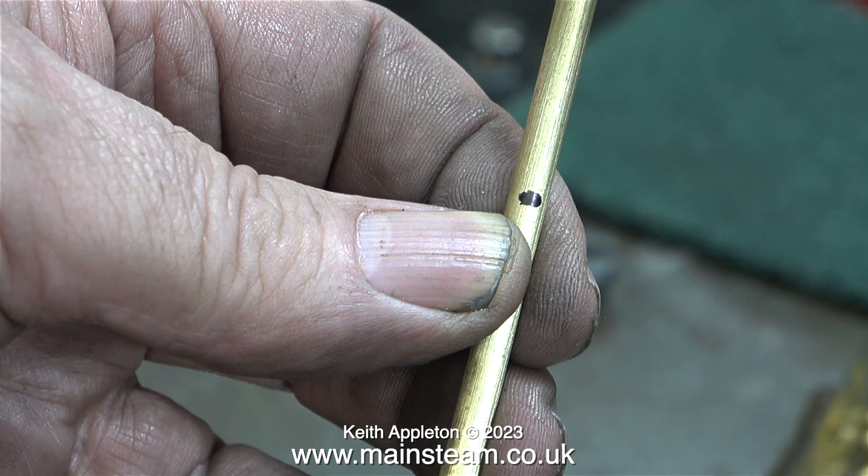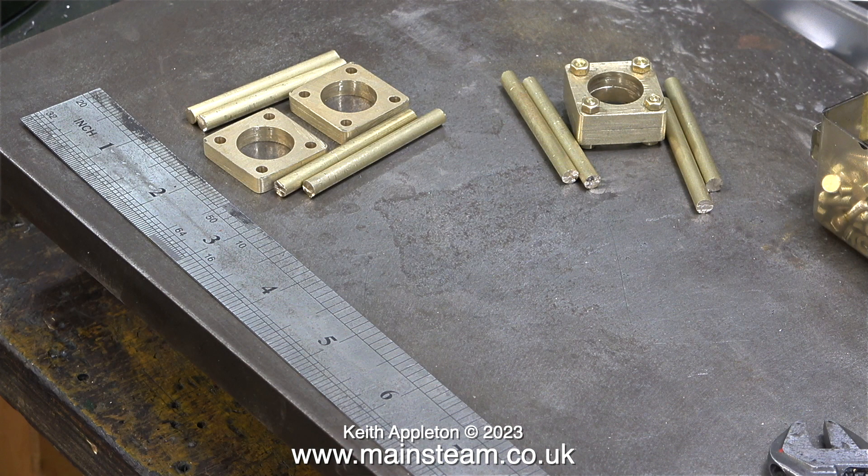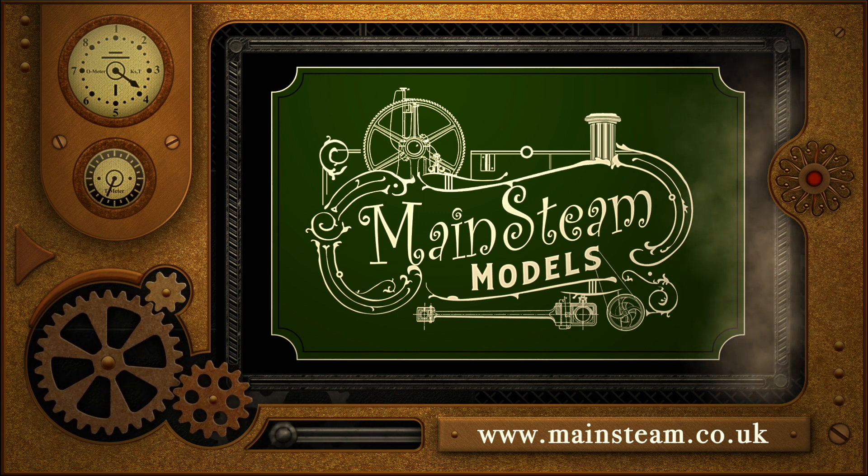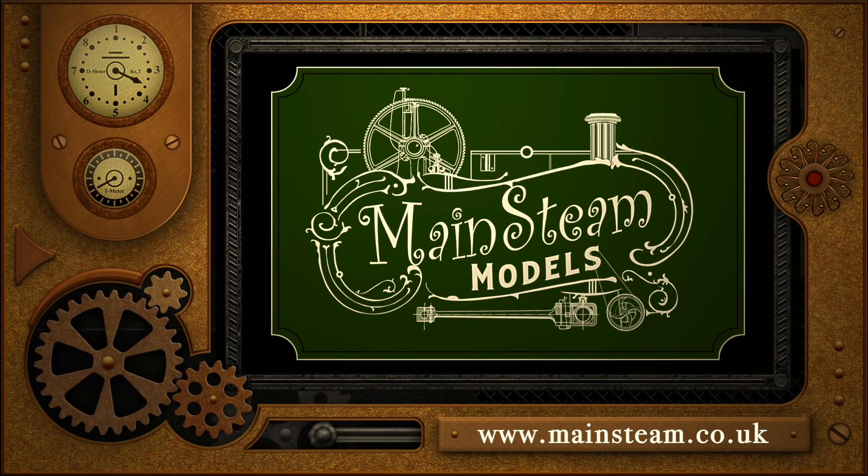I'm going to make the protective bars from three sixteenths of an inch diameter brass, and here I've marked a piece of brass bar using a felt tip pen — this is just oversized to allow for machining in the lathe. Here is a nearly complete set of parts for the water gauge protectors. In the next episode I will machine the protector bars, thread them 6BA at both ends, drill and thread a hole into two of the blocks to use a pinch bolt to hold them in place, then finally fit them to the water gauges and see what they look like. That's it for this one — stay safe, stay healthy, thanks for watching and I hope you found it useful. Please visit my Mainsteam Models website and click on the Video Playlists section to find other videos you may like to watch.